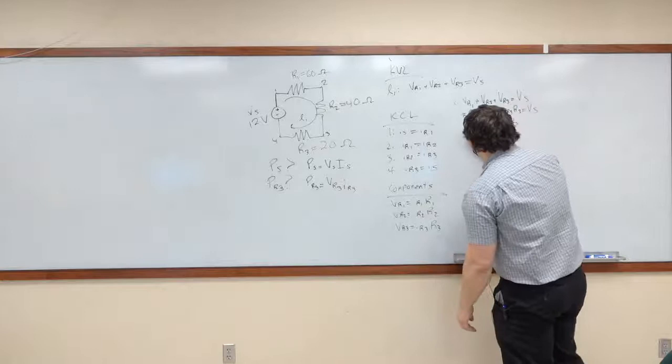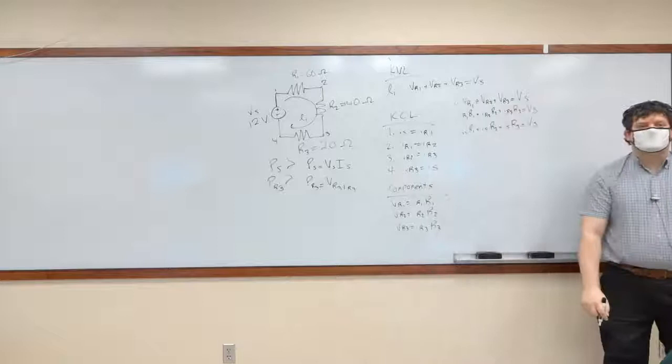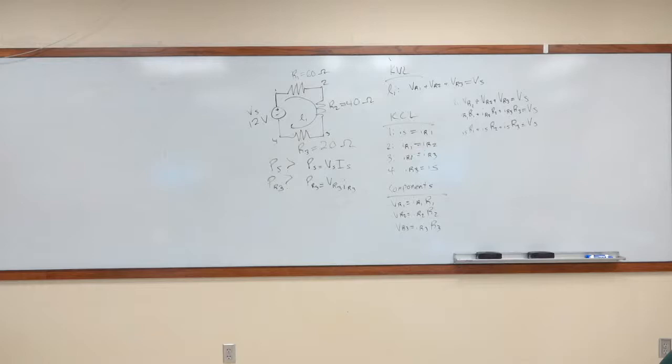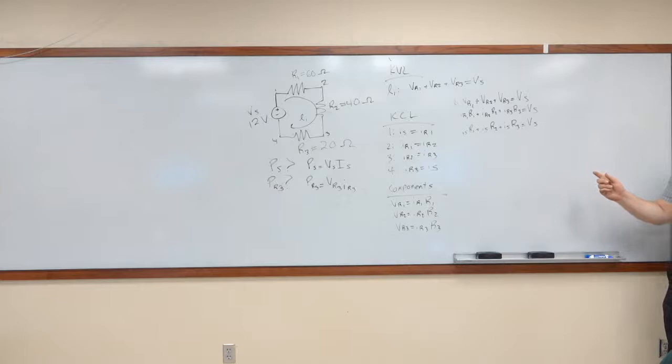All right, so IS times R1 plus IS times R2 plus IS times R3 equals VS. How many unknowns do we have in that equation? Which one? This is the only one we don't know. We can't quite substitute yet.